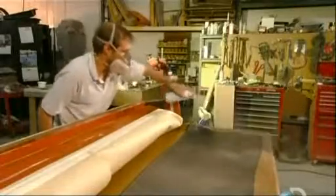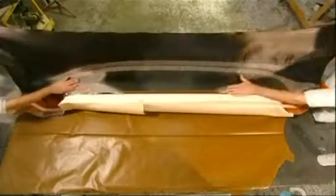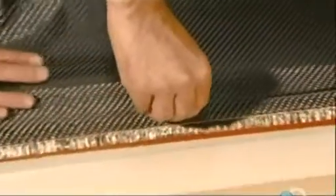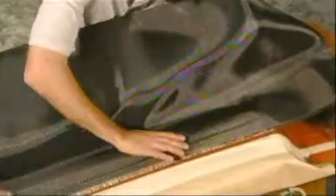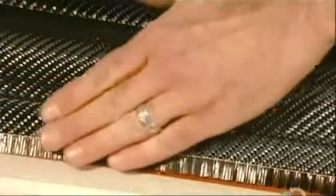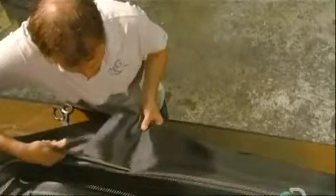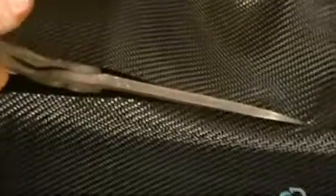Despite the non-stick coatings, they'll want this fabric to stick to the mold for a while. The glue will gradually dissolve into the material. They press the glued carbon fiber material onto the lip of the mold. After all, they don't want any wrinkles in this job. This material has yet to gain its steely strength, so they easily trim the excess.